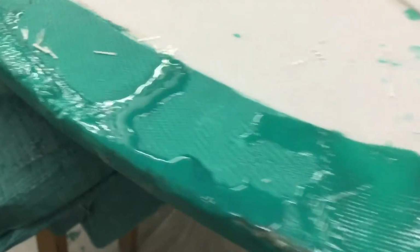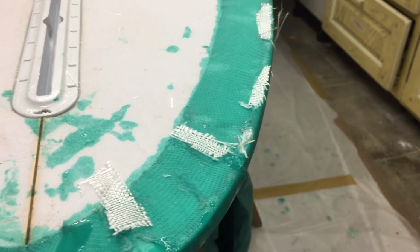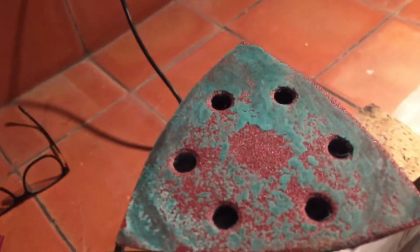So I've tried to remove all the air bubbles by cutting out the sections and adding a little carbon fiber. It's definitely messy, but hopefully it'll do the trick. Same process on this side. So I'm currently trying to sand all of the irregularities out of it using this, but it's sticking to the sandpaper, and so I think I'm gonna have to use a lot of sandpaper.